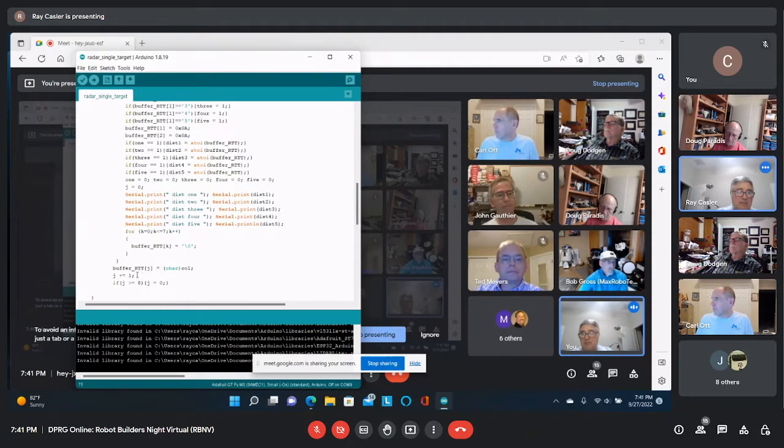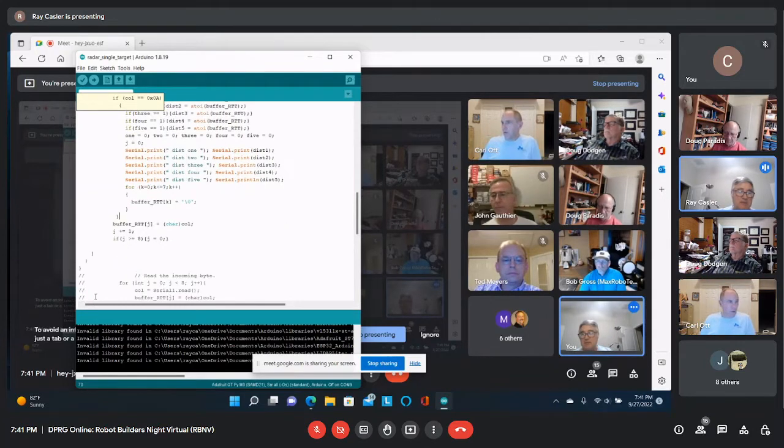And the other part of the loop is, yeah, if the character read is carriage return, then do all those things. Otherwise, stick the character that I just read into the buffer, increment basically the J or the index value. And if it's equal to or greater than 8, put it back to 0. And that's kind of the whole function.